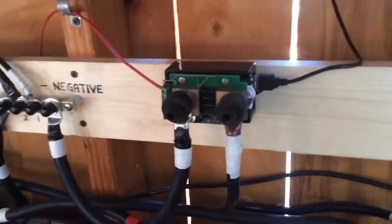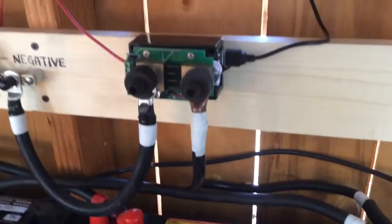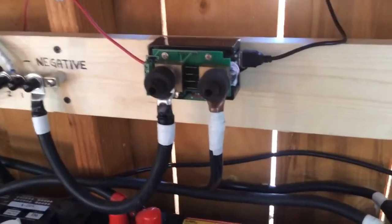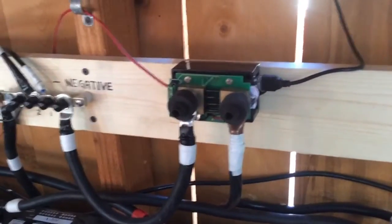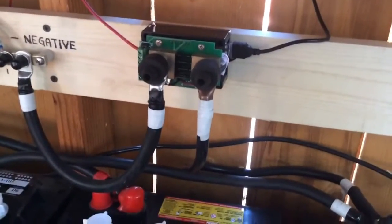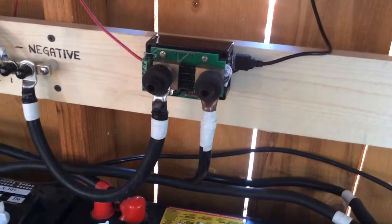How do I know the inverter is drawing 20 watts? Because this right here tells me I'm using 20 watts when I've got nothing going on over there - I'm still showing 20 watts coming out of the inverter just to have it powered up. That tells you a lot. If you can't afford the Bogart, I found this and it does basically the same functions - tells you everything you want to know, and you just can't beat it. It actually comes with this display and the cable here just powers it up - everything else is wireless, it just sends a signal. Really, really good. Now I can keep track of what's coming out of my battery bank and how much I'm using on the AC side.